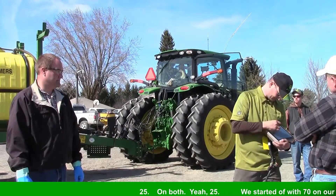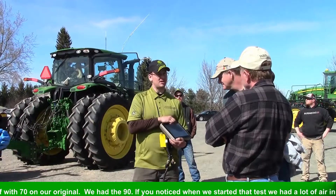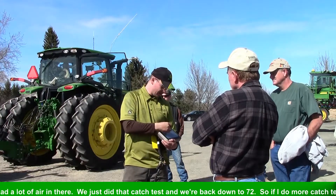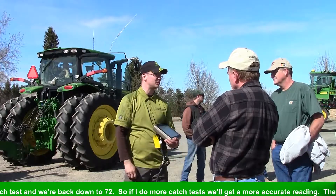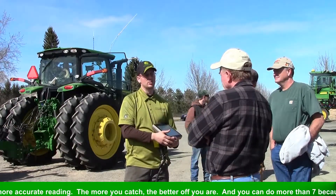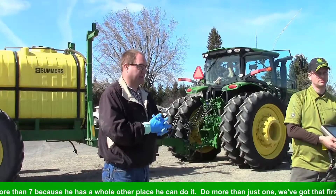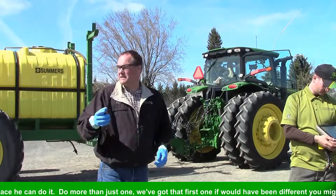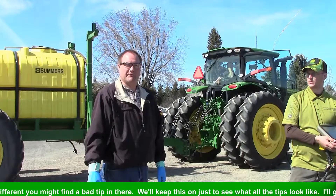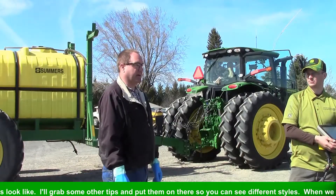On those, we have 25 — here's a conversion for 20. What that did: we started off with 70 on our original, we went to 90. And if you noticed, when we first started that test we had a lot of air in there, but he still caught that — we put that 15 in, it was 90 on our calibration number, and we just did that catch test and we're back down to 72. 70 is where we started, which is actually the factory calibration number on the flow meter. So by doing more catch tests, we'll get a little more accurate. The more you catch, the better off you are. And you can do more than 70 because you have a whole other page on that too. Do more than just one — if we had just done the first one it would have been different, and then you might find a bad tip in there. We'll keep this on before long just to do a nozzle flow test to see what all the tips look like. I'll grab some other tips and we can put them on there so you can see different styles of tips.